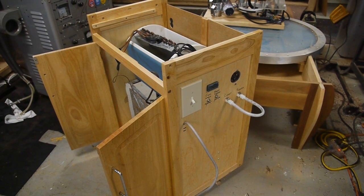Not only is that wasteful, I don't have very good control of the temperature. So this unit here is basically a water pump, an air conditioner, and a heater, and the heater and air conditioner are controlled by a PID controller.